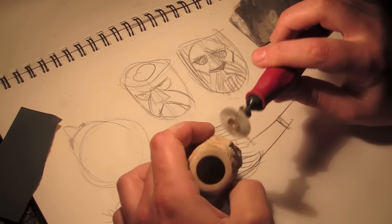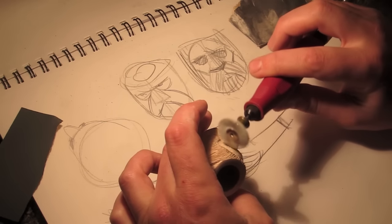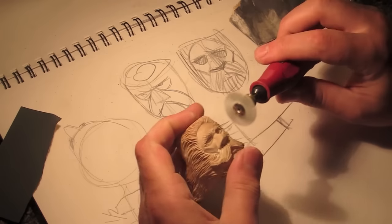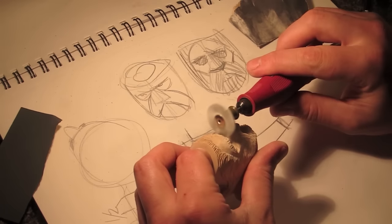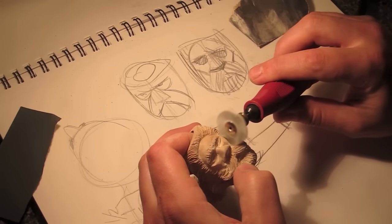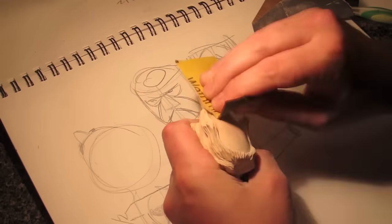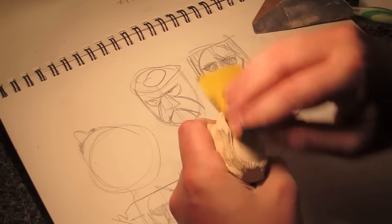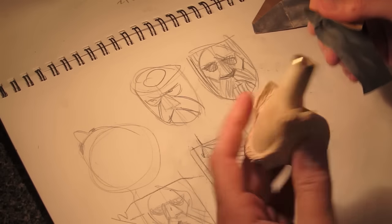These are weird little radial brushes. You can get them from 3M — they make them in a bunch of different grits. Dremel makes them too but they're really expensive, so look on eBay for 3M radial brushes. They're really good for getting into little places. There were also these little almost-steel-wool discs — I used those a lot too. Whenever I could, I just used sandpaper by hand with high grits, since those finishing discs for rotary tools go really quickly.